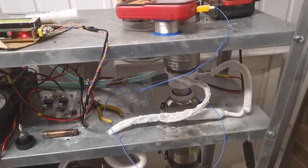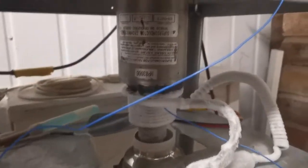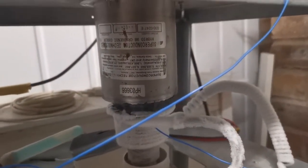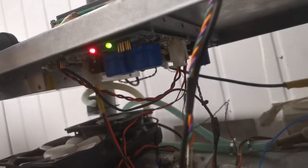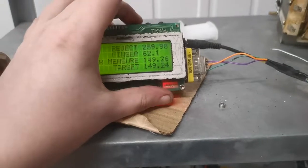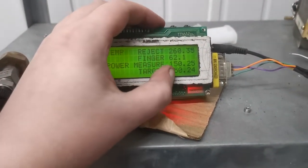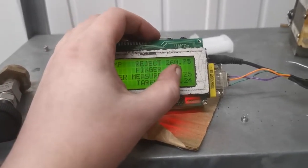This is just a quick overview of my liquid air stroke liquid nitrogen machine, based around a Stirling cycle cryo cooler. This is the Superconductor Technologies hybrid 98, pulled from an RF super filter. To drive it I'm just using the original control board running in debug mode with a little homemade controller, which lets me arbitrarily set the cooler power level. Currently running at about 150 watts with a rejection temperature of 260 Kelvin.